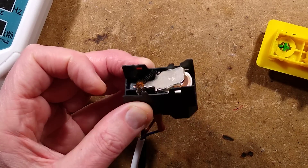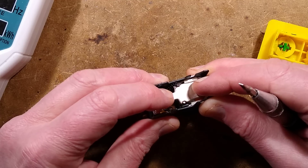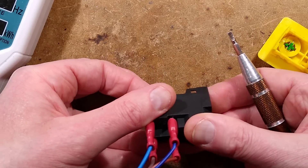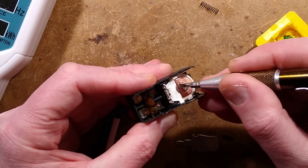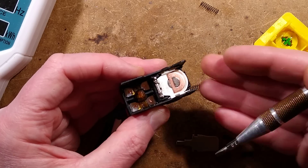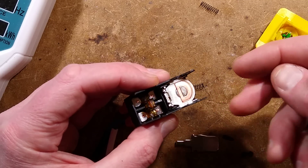Let me get down so you can see this closer. Here is the coil. The plate gets pushed down, and when you press the stop button it actually doesn't just break that by pushing the keeper plate off the magnet - it also forces the contacts open, so even if they'd welded it should actually force them completely open. Now removing the actuator plate - the little tongue that goes into the actuator rod - and tipping the springs out as well. We can see the coil has this unusual copper plate across the central pole of the core of the magnet. That is a shaded pole assembly. What that does - because this is being run on AC - is reduce the buzzing by causing a slight phase shift magnetically. It basically rides over the zero crossing point so you don't get such a loud buzz. It may hum quietly but it's not going to be as bad as if it were a bare core.